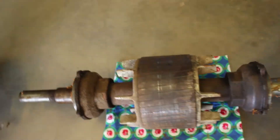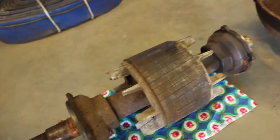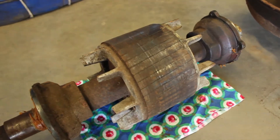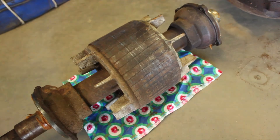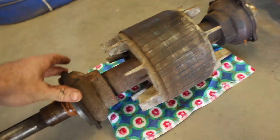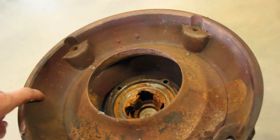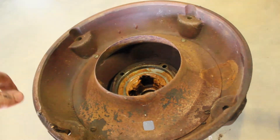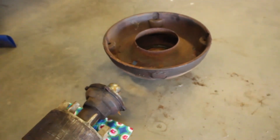It's actually a pretty simple design, and as long as the motor doesn't get hot and the stator doesn't burn out, or the bearings don't wear out and collapse, the motor will basically last a very long time. I've got no worries about this motor working again. I'll give the housing a clean up, get all the dust out, re-grease and pack the bearings. I might give the inside of the motor a repaint using some heat-resisting paint, then reassemble it all, repaint the outside, and that part of the restoration will be done.